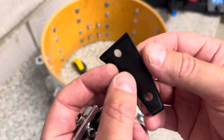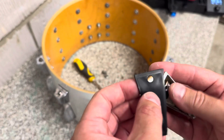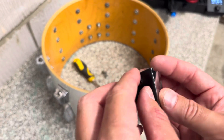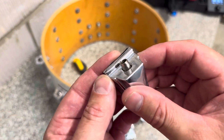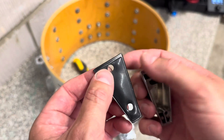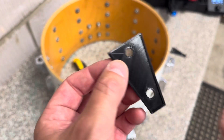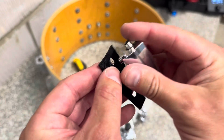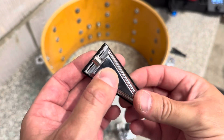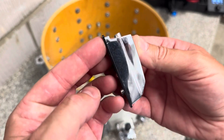These are the gaskets I made and you can see they've distorted quite a bit. I tried to design them size for size but that just doesn't work out — the pressure when you squeeze them means it never finishes flush. With the new ones, which are TPU — flexible but holding a more rigid shape — they'll actually sit in the recess, be uniform, and look so professional.